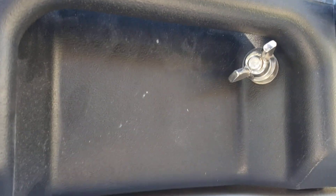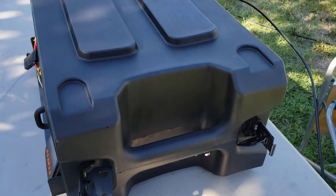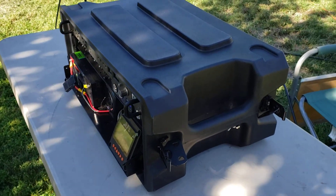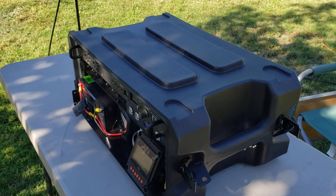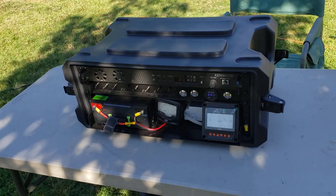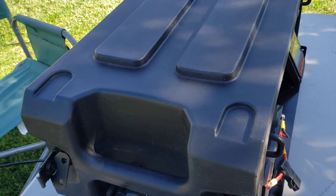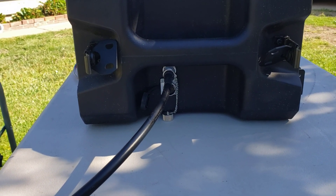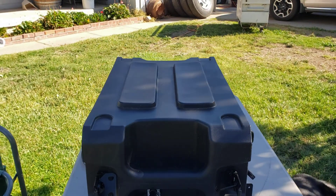Notice that all the side connectors are in the indentation of the handle. The reason for that is when transporting in a truck, the case might slide around and a bolt sticking out could slam against the tailgate, breaking the connector and shoving it back into the case. By indenting everything, you'll hit the handle before you hit those lugs — nothing gets shoved back into the case.